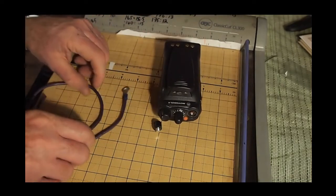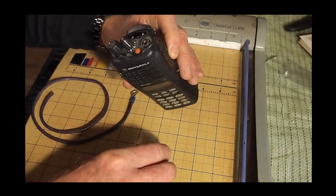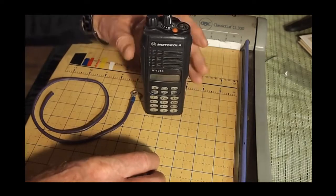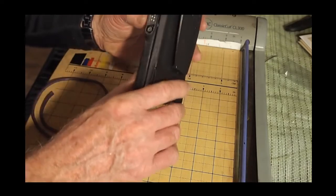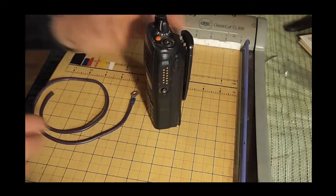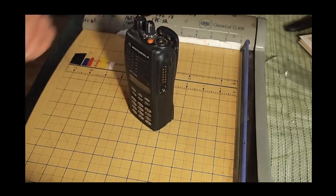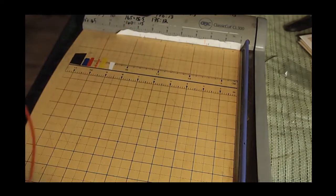And so the question would be, with something like the Motorola, how am I going to get a counterpoise set up? Well, you're going to have to find some grounded area and fashion some way of doing that, whether it was getting at some negative part by finding it on one of the connectors. Obviously, a little more difficult, a little more messy. And maybe that is why another device comes along, and this is called a rat tail as well.